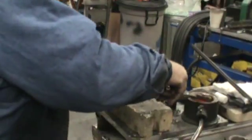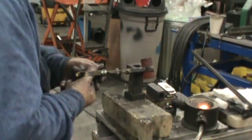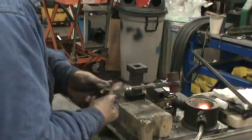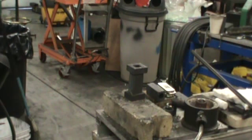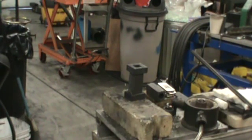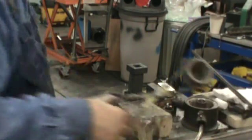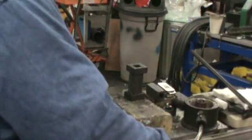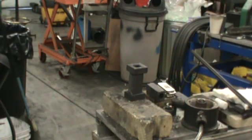We pick that up out of there. I always turn my tongs over — that way I pour a little more evenly. I just go ahead and pour that. I'm pouring this more or less like a vertical pour mold, but the pewter is so easy that I don't have to heat the whole unit. This taller size is primarily for people with taller kilns and bigger furnaces. The new furnace really does a nice job — it'll do a pound of 99.9 copper in about 10 minutes.